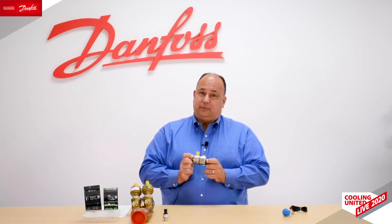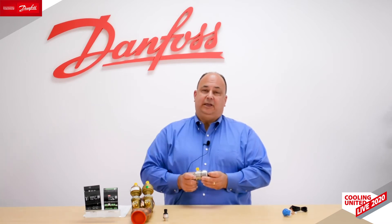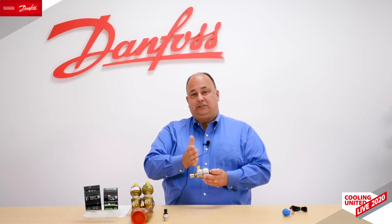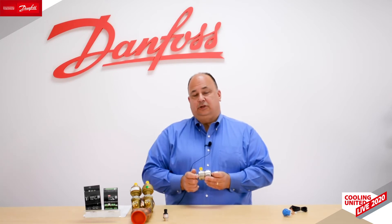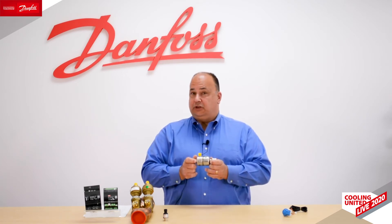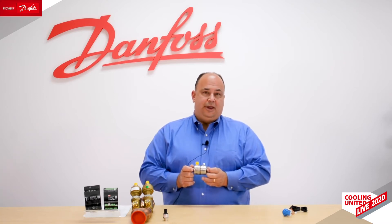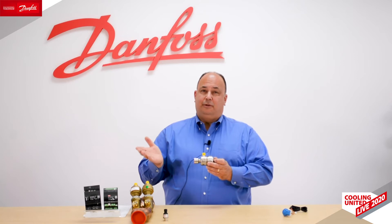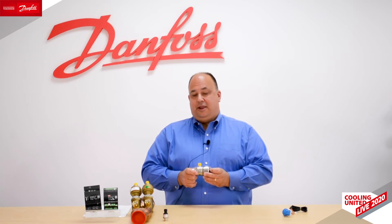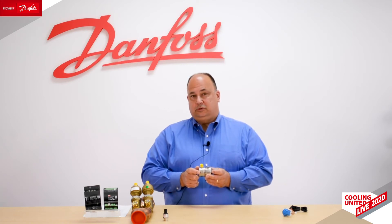This is a very fast opening and closing valve — it goes from fully open to fully closed in about six seconds, minimizing refrigerant return to your compressor on shutdown and protecting it. Something both the ETS-5M and ETS-C Colibri have in common is they are 100% hermetically sealed — fully welded with no threaded connections. That's important because going forward, most refrigerant alternatives will be flammable or mildly flammable, so we want to fully reduce leak potential through either valve.